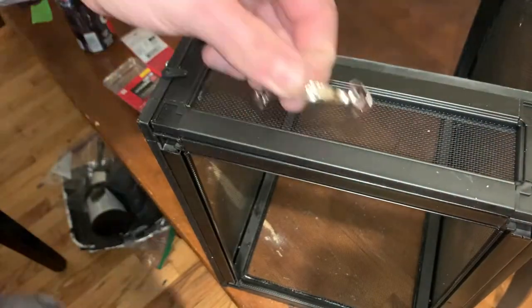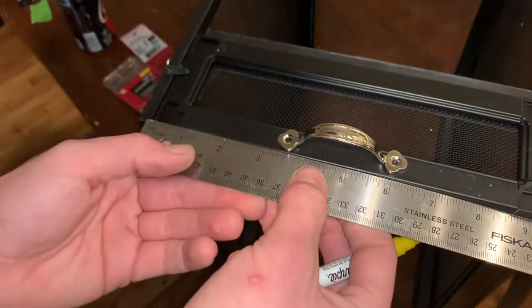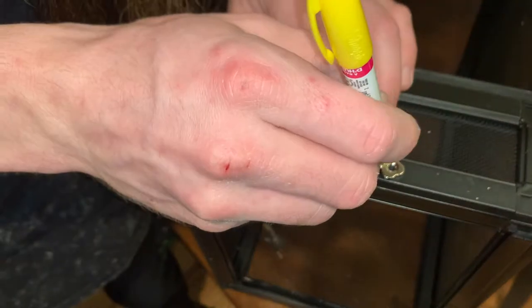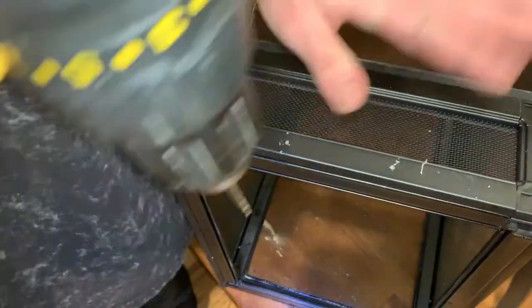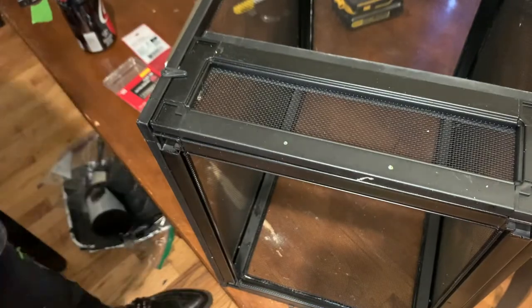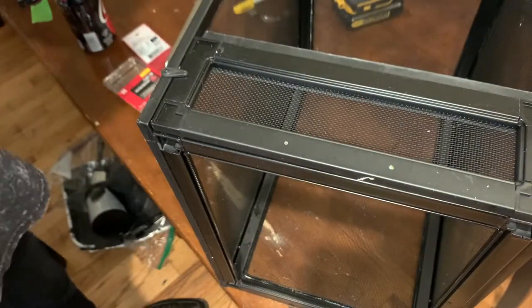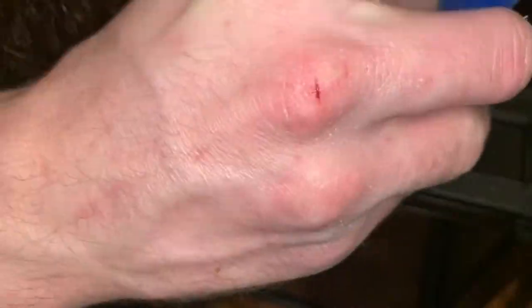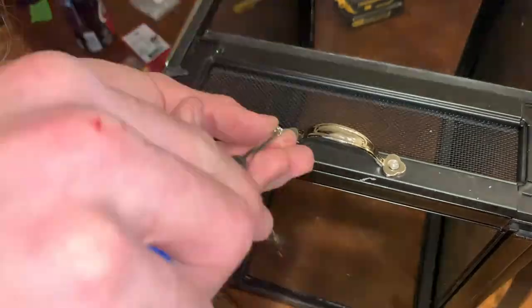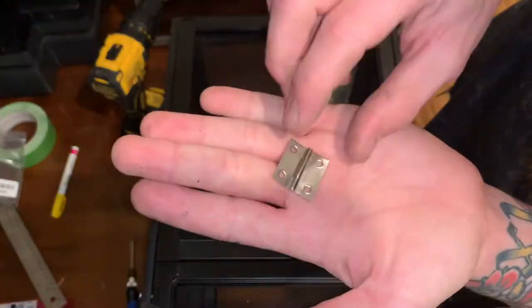For the handles of the service door and the main door, I used some handles I found on Amazon. I searched for hours trying to find a handle that would fit this aluminum frame. If you're interested in these, I'll go ahead and leave a link for them down in the description of this video. To attach them, I made my measurements and then used the same really tiny drill bit to drill pilot holes, and then used some 1/4-inch micro screws to hold them into place.